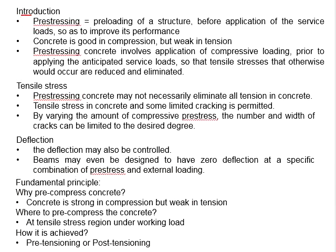We can say that pre-stressing is a method of pre-compressing the concrete. Why do we need to pre-compress the concrete? It is because concrete is strong in compression but weak in tension. The tension capacity of the concrete is about one-tenth of the compressive capacity. That means if we can maintain the entire structural element in compression, we have a bigger range of stress allowed within the member so that the member does not fail.